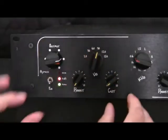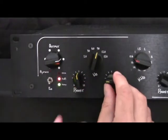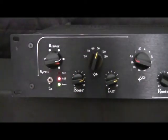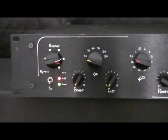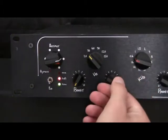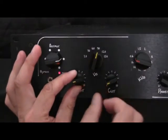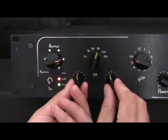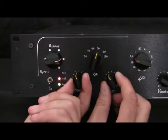The low section allows you to boost and cut the signal at the same time. The cut control acts on a frequency multiplied by 10 times the value you read on the selector. For example, if you select 30 Hz, the cut control cuts on 300 Hz. The boost control acts on the same frequency you select. The displacement of cut with respect to the boost creates a very smooth musical curve without gaps.